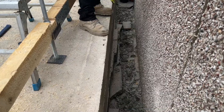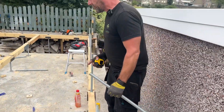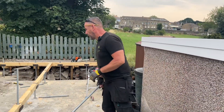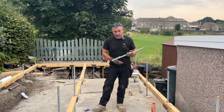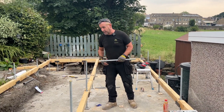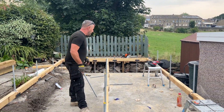What they've done is they've built a breeze block wall and then shuttered a pad and put a pad in. Can you see the thickness of that? It's approximately eight inches, which is near on 200mm. That is more than sufficient to take the weight of this building, and it's also got rebar in it — that's just metal inside the concrete which helps maintain its strength and make it stronger.